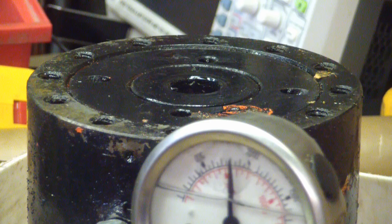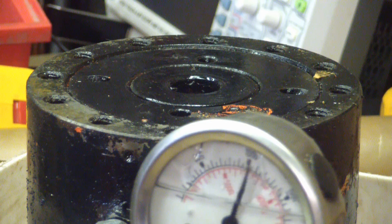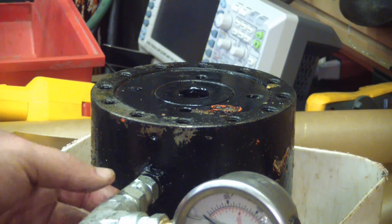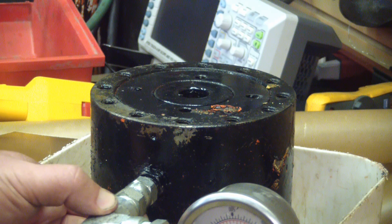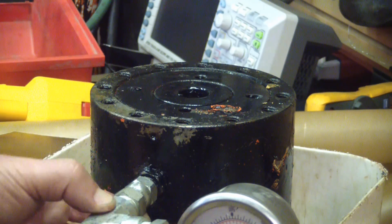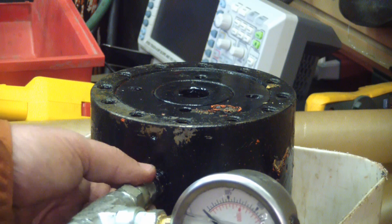You see how quick that came up to 1,000 PSI? We're either seized or we're bottomed out. I'll flip it around and try again. Instead of hitting the release I hit the pump — it's just that easy. So for you kids at home: if you start taking off fittings, especially hydraulic fittings, and there's oil leaking everywhere — stop. Put it back on. See where the pressure is coming from. Something's going on. Don't keep taking it off until it flies out and kills you.